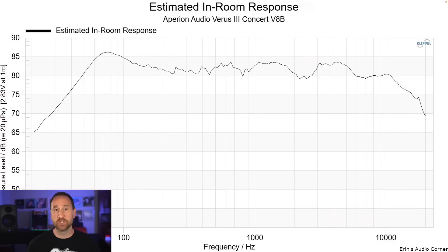This is the estimated in-room response, which is a good indicator of tonality in your room. It's best used above about 500 Hz, since below that the sound is dominated by the room rather than the speaker. If I draw a trend line through here, we can see the mid-range scoop relative to it, a little peaking in the 1 to 2 kHz area that's going to sound a bit tinny, and then peaking in the 3 to 5 kHz area where I was hearing sibilance. Around 10 kHz we see the peak again — that's where I heard the over-detail from the hi-hats.